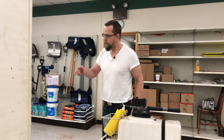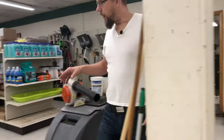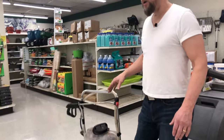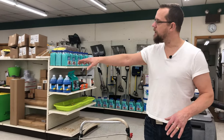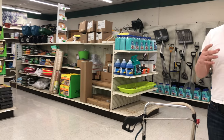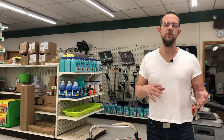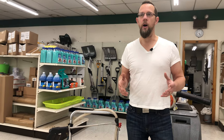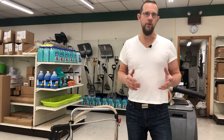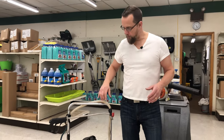So in the sprayer here, I have the stripper. A lot of guys mop it down. I used to do that, and it would run under the islands and it would bleed out all night and cause stains on the wax. So that depends on how uneven your floor is. Now when I spray this down, I have a lot more control. I use at least half the stripper that I used to use, so I use a lot less product.